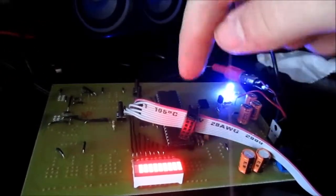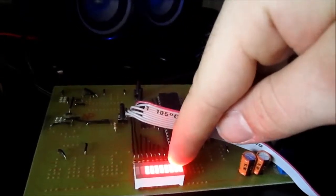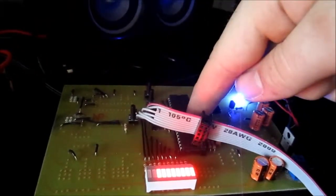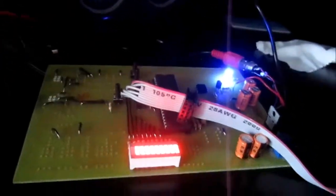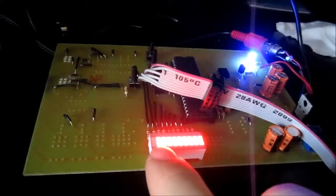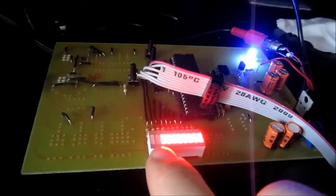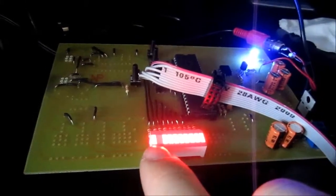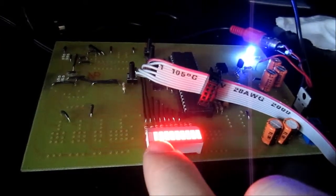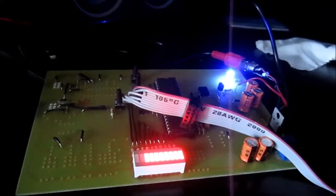So it's 10 times a second, 10 hertz, which is 100 milliseconds. It's getting a trigger from the iPod to move on to the next data frame. And these are all the data bits. They're not programmed yet. This one flashing here is flashing every second to make sure that it's incrementing. And then this last one here is 0. Okay, it was end of the show. So it zeroed out, and then the show looped back again. So that's what I got done so far.